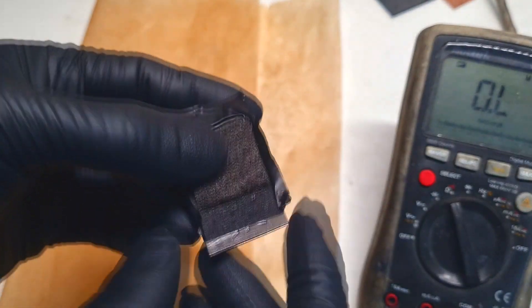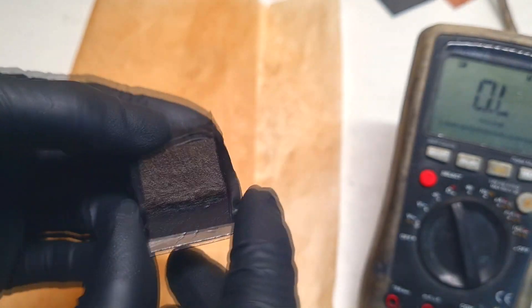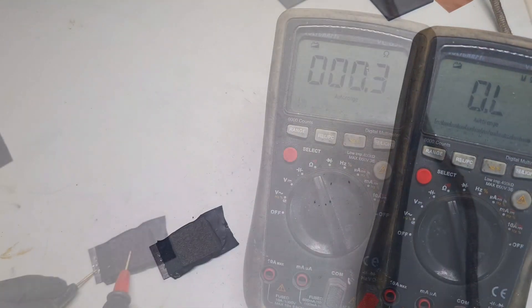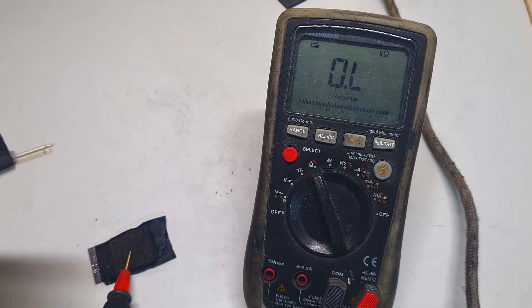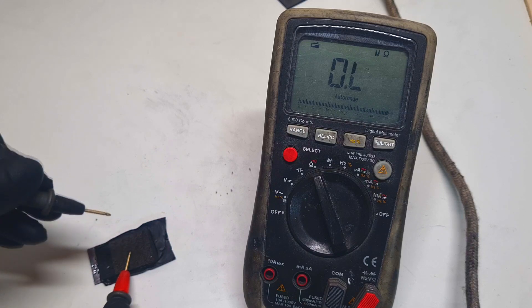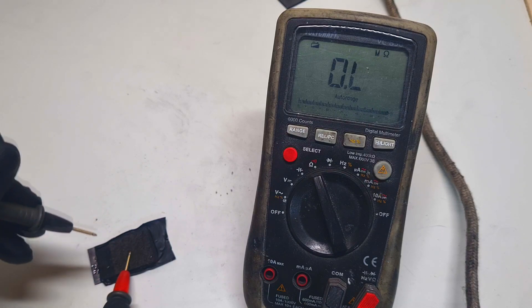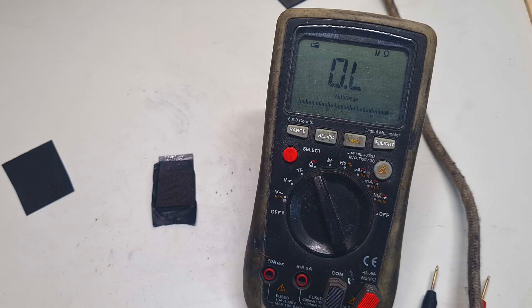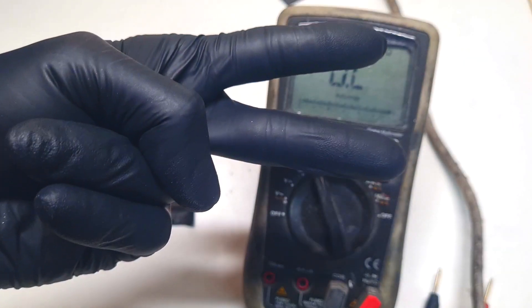And actually, that's it. In this case, you have your completed electrode — not only the current collector, but the completed electrode. The resistance of the entire electrode right now is 0.2-0.3 ohms. This is the resistance between the graphite, carbon felt, HDPE, and the graphite foil. That's it for now and we'll see you in the next video. Bye.